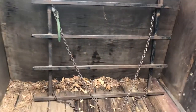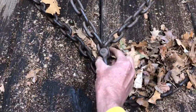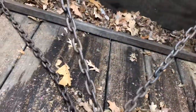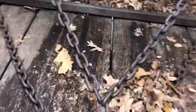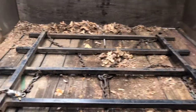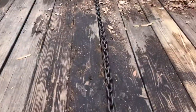Slide this back, lean it up against the wall, squared up a little bit better. Then you can climb it like a ladder right on out. You see that this chain is one continuous chain. I count the chain links on this one, find the middle one, and then we D-ring it to one of these and then this chain is one chain length. One chain — it counts to the middle chain link and there it is. So you can imagine when this pulls, those would all pull evenly.